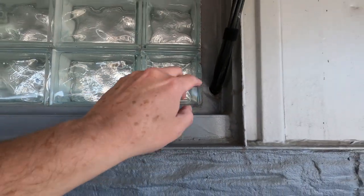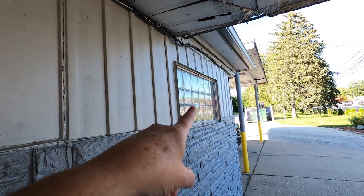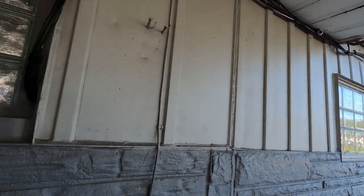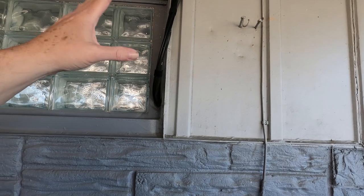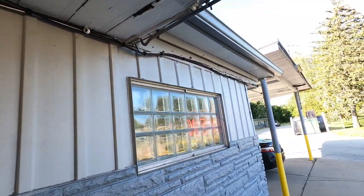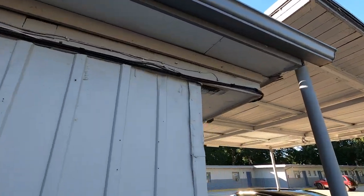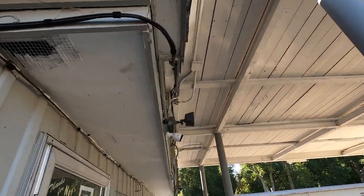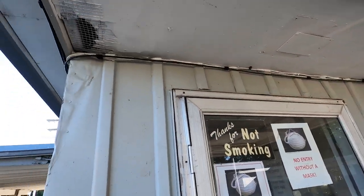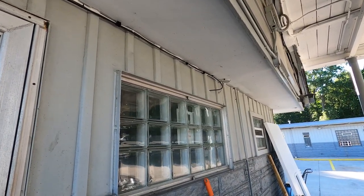So effectively, what occurred is there's a Keystone jack on one end of the cable, and then there's a Keystone jack on the other end of the cable. It's an ideal situation for the unshielded non-direct burial outdoor cable because it doesn't need to be shielded in this case, and at the same time, it does not need to be direct burial. So it's pretty easy to work with, and it definitely got the job done. In this particular case, the cable is being used to connect up a credit card machine with a switch.